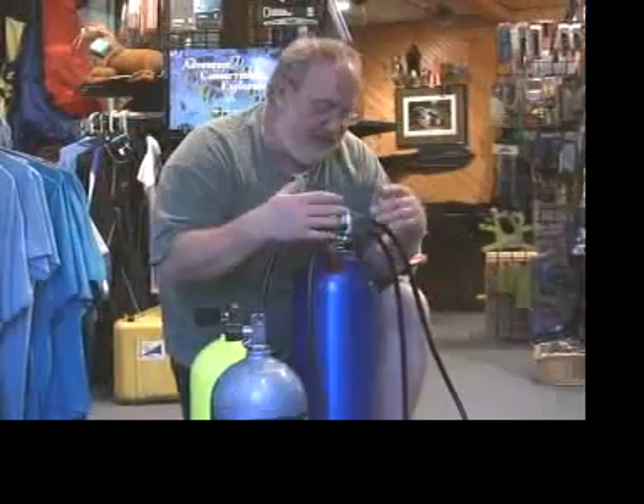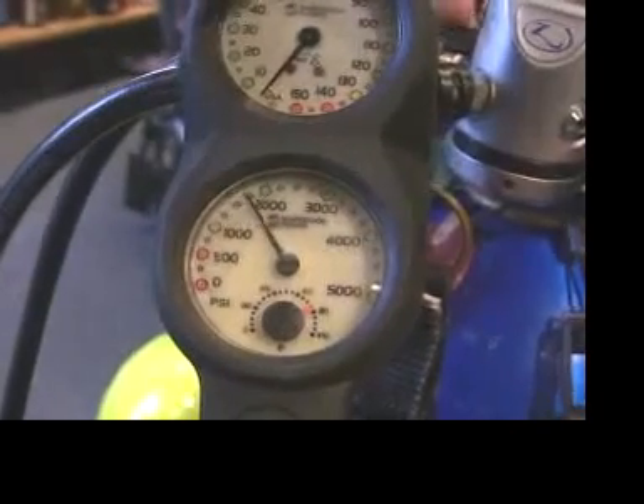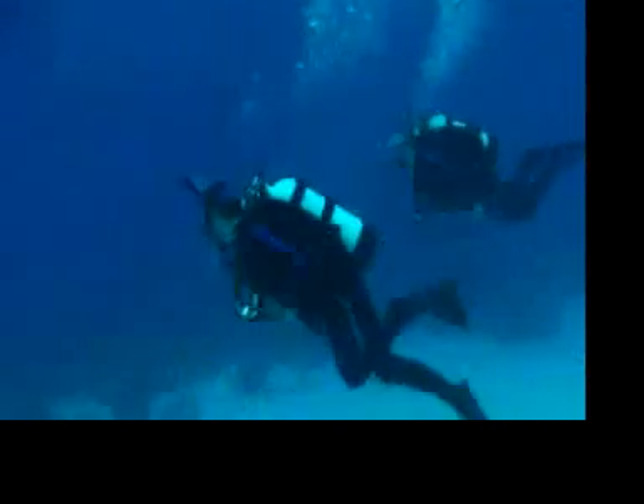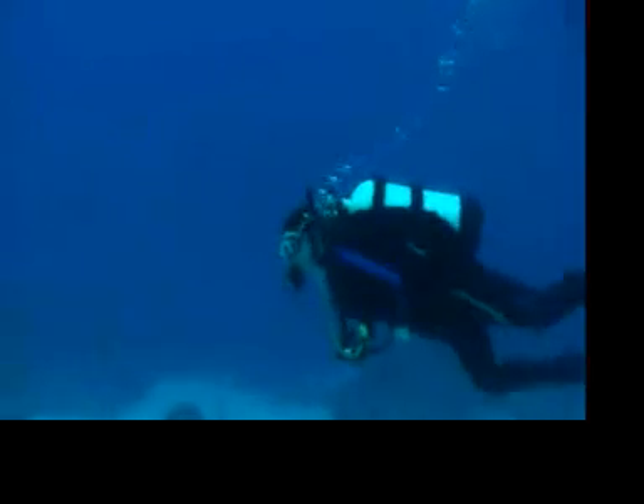Of course we want lots of air when we're underwater, so we can turn it on just a little bit and keep bringing it up. You can see how much air we're going to push out. We have a regulator hooked up to the scuba tank — at 3,000 PSI it would be very difficult to breathe, so the regulator breaks that pressure down to a usable amount you can breathe through comfortably underwater. The more air we can push into that scuba tank, the longer we can spend down there seeing exciting things.